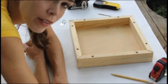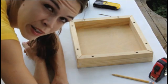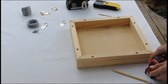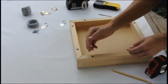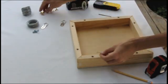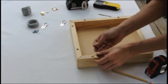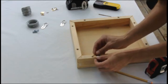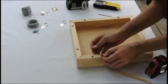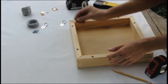Let's look at what you do if now you've got your hangers in the wall and then you realize, oh no, the thing that I want to hang doesn't have a way to hang it, and I don't just want to hang it on bare screws. I find that it's best often to put the hanger about 1/3 of the way from the top. Now with this, it's light enough that I could pound in these tiny little hangers, and you can put them on the back or on the inside, it's your preference. For me, if I have the option, I like my things to sit flush against the wall, so I'll be putting them on the inside edges.